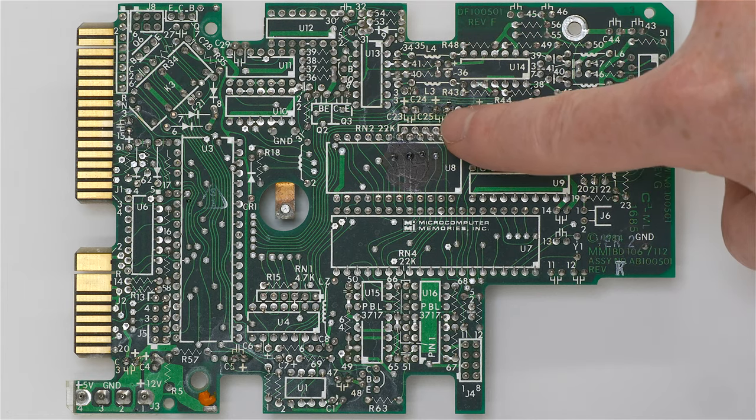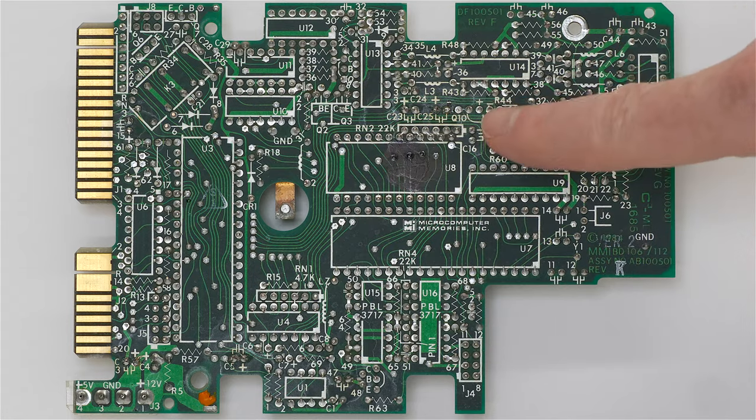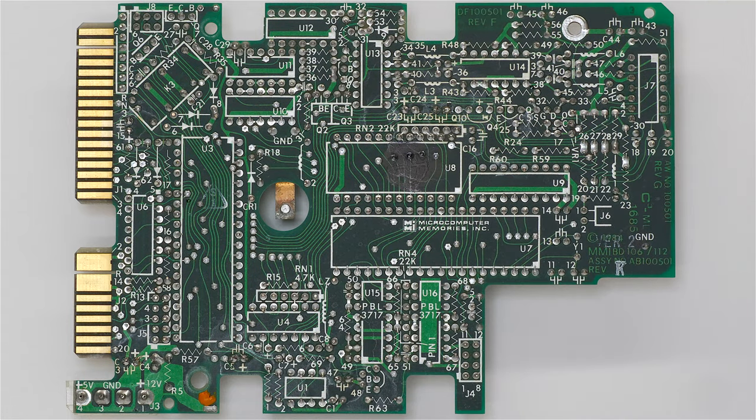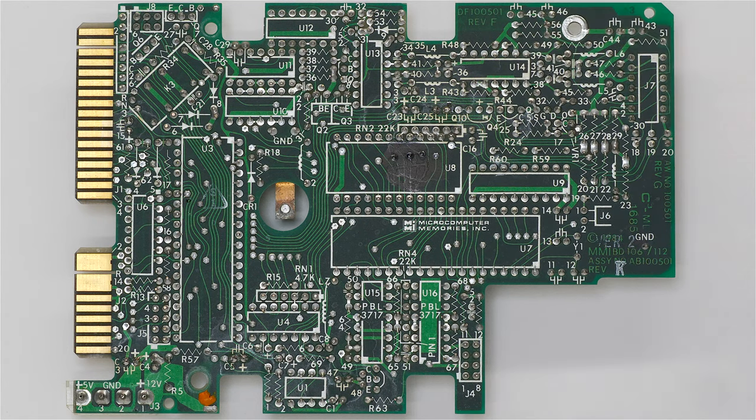That's why the silk screen turned very, very slightly yellow, in order to heat up this whole general area, in order for my soldering iron to heat up the area and get most of the solder out of the ground foot of the capacitor holes. But even then, I still had to use my little poker to poke a hole through. But finally, I prevailed, and the board is completed, as you can see here.